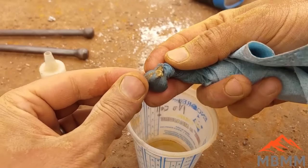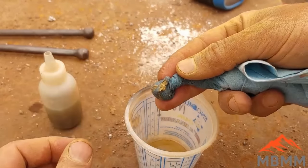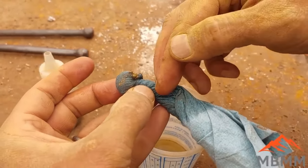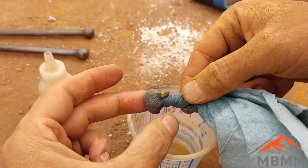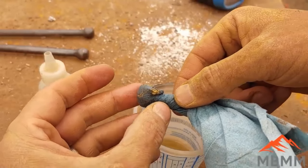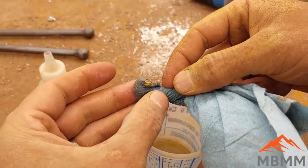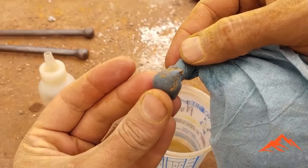I'm not going to be able to get as much water out as I hoped. Okay, don't rip it. In the future, don't rip it. What I'm going to do now is just cut it off here and put this in our cupel. It's in the furnace. It's hot, and it'll evaporate all the water off. It'll burn the rag, and it'll leave our gold all dried out in the cupel.